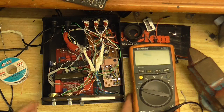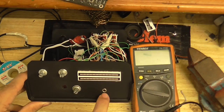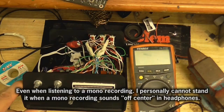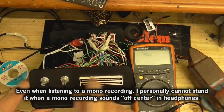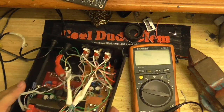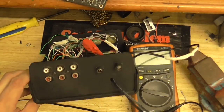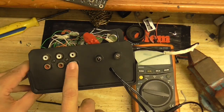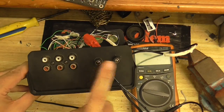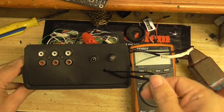Let me just give you a little brief tour of it. This is the front panel — we've got the level meter, volume control for the speakers, headphone sockets, and left and right volume controls for the headphones. Because there's always one headphone that sounds louder than the other one, having dual controls for the headphones makes more sense. And on the back we have input one, input two, auxiliary output, and this is the input for the mixer. Power input for the mixer. This is the power input for the amplifier, LED meter, and headphones. And these wires are where the speakers connect.